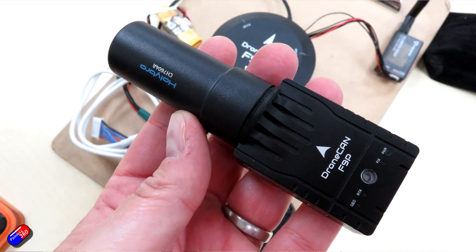There is another use of RTK — a growing need for some vehicles where the compass doesn't perform very well. You can actually put two F9P units on an aircraft, and because you have such an accurate position of where these GPSs are, you can use that for heading. They need to be a minimum 30 to 40 centimetres apart — the bigger the better — and that's sufficient to give a heading, eliminating compasses on aircraft where that has been challenging due to interference, cable routing, or motor size. There's also a technique called a moving base, where one GPS on the aircraft acts as the base and the rover is corrected relative to it.